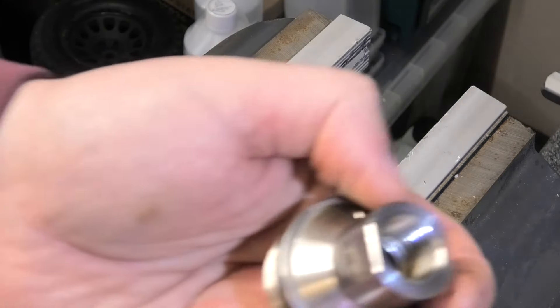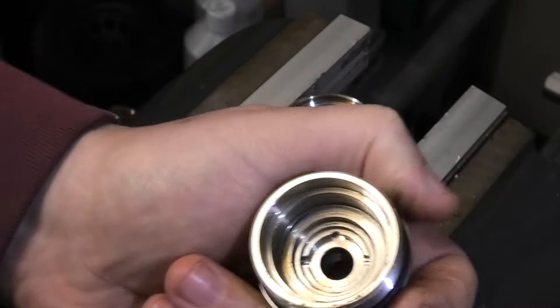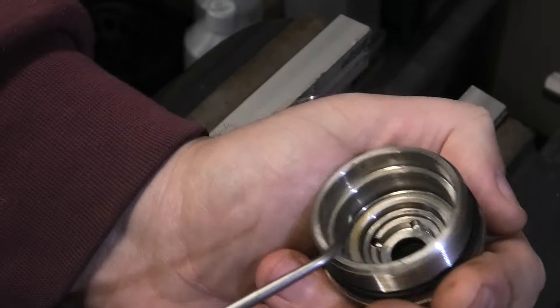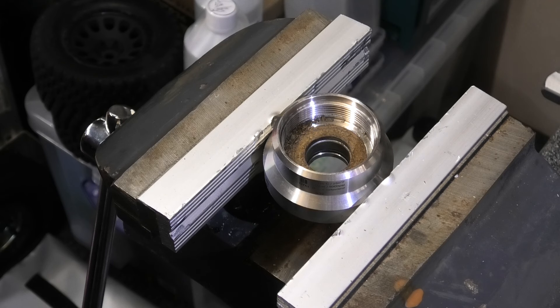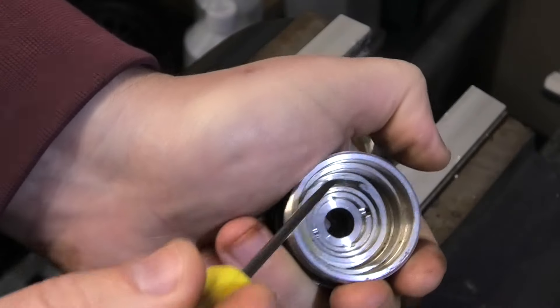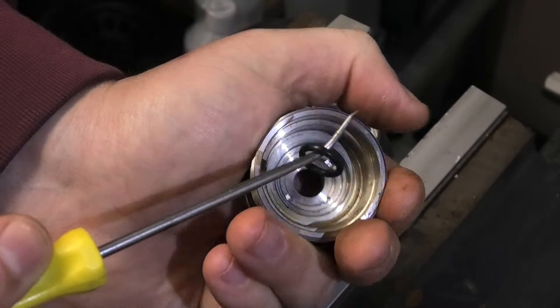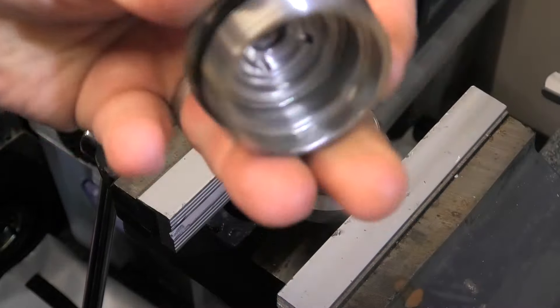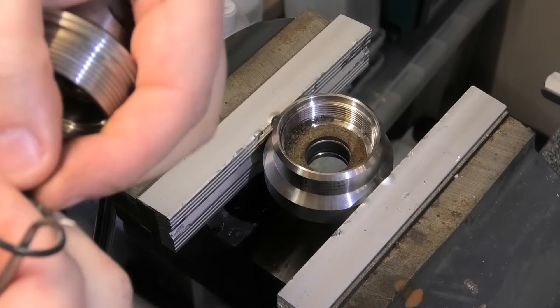Let's get some better light here so we can see clearer. Going back to the top cap — all the internals are out now. Right in the back there is a very small o-ring on the inside, which is what the carbide seat seals on. Using a small engineer's pick, you can just ease that o-ring out of the inside. They can be quite stiff but will pop out with a little perseverance. There it comes — just a standard run-of-the-mill o-ring. I do like to use Viton o-rings here. And there's the outside, the larger of the o-rings, which seals the top cap to the main body.